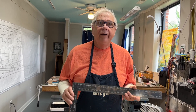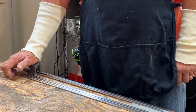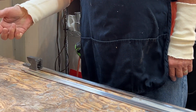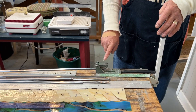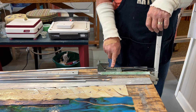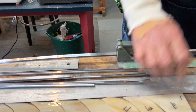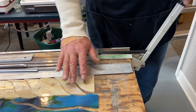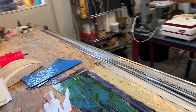So now we're stretching lead. This is a lead vise — your lead actually goes in there by about an inch. I usually just push it down a little bit. I use the Stanton stretcher. You hold down on it because it has a lead vise attached to it. This is our three-eighths lead. Watch this — it just jumped right up and we stretch it about three inches. That's it.